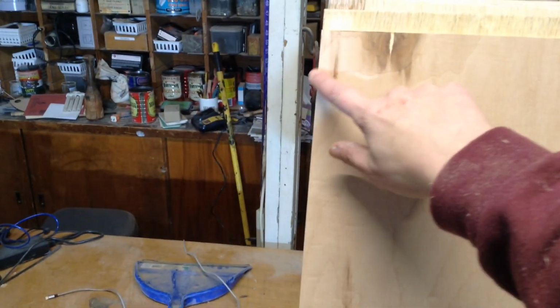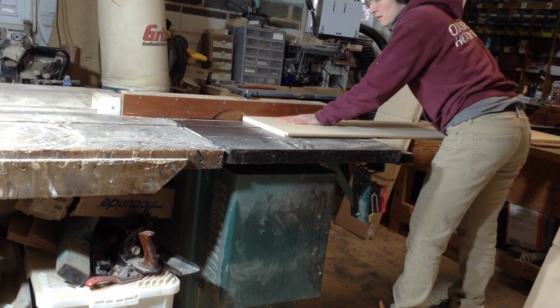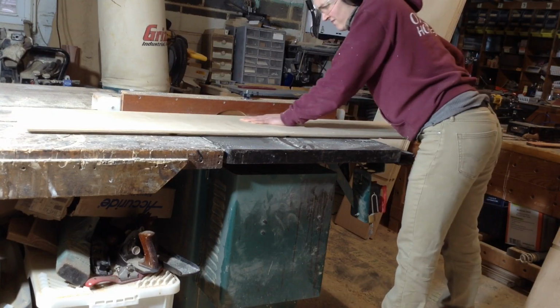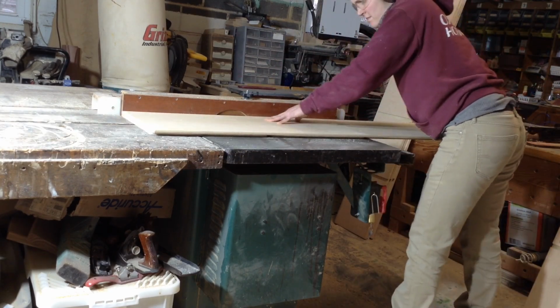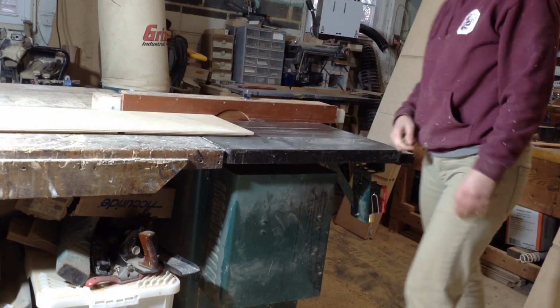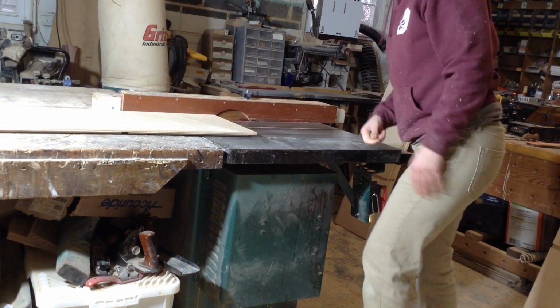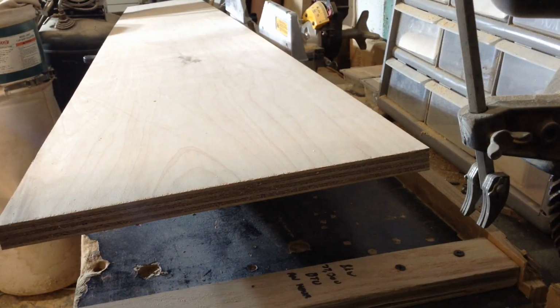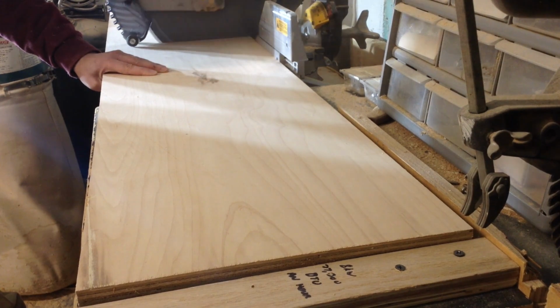So then you can see I moved the fence over, and now I'm going to do the 1/4 inch rabbet in the front, and that is going to be for attaching the face frames. Same exact process. I keep these broken into sets of 4, because you're going to have to make that rabbet on opposing sides, and I just send all that through. These are very simple joints to cut, and now that I have this process down, it's pretty easy work.